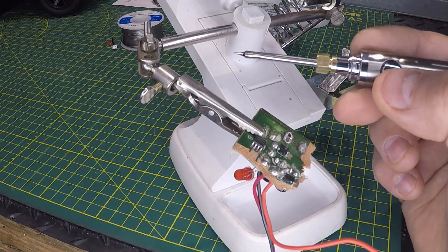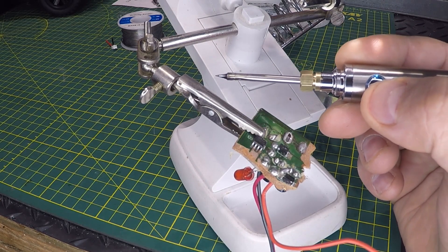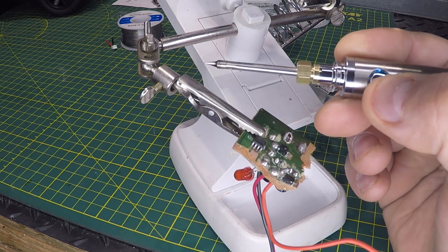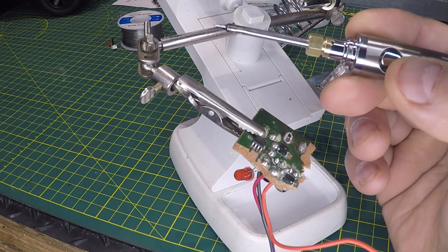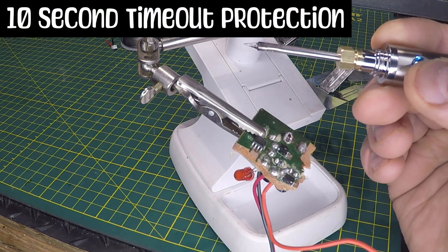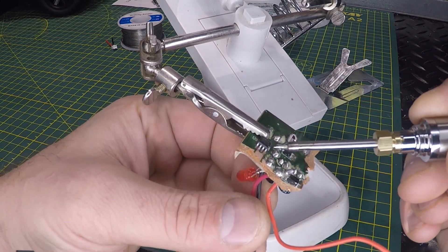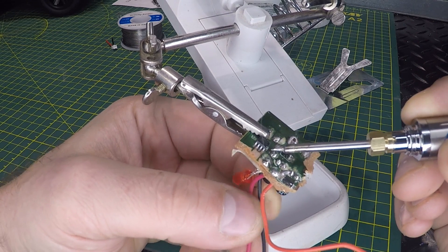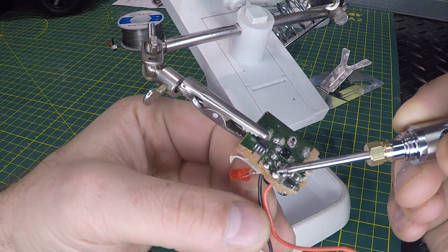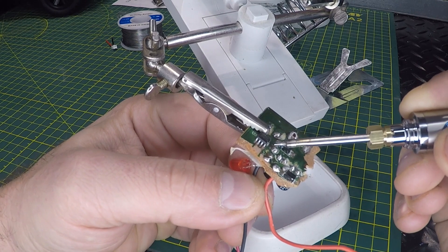We've got the board set up — going to heat up the iron. I'm checking something here: sometimes soldering irons only allow you to hold heat for a certain amount of time. Yeah, there we go — see it's blinking and it turned off. Keep that in mind; usually it's about 15 to 20 seconds. So the iron is hot, you just release the button and activate it again. Oh yeah, it's melting that pretty quick. That was quick and we got a lot of solder on this negative lead.